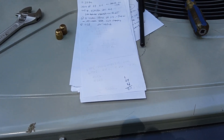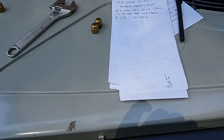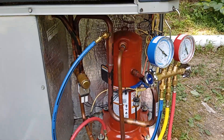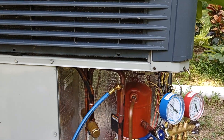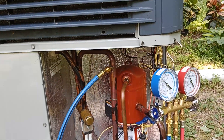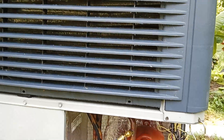So there's the answer to temperature-difference charging instead of buying that $300 heating pad — get a bucket of water, it's free. The key caution: airflow through the outdoor coil is in control of the pressure and temperature of that coil.